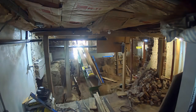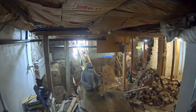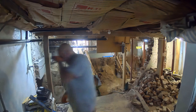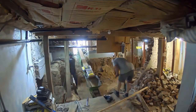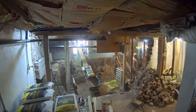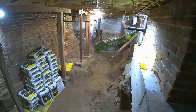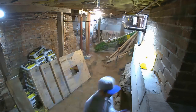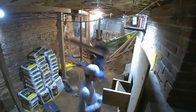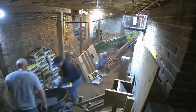They build the forms right on site since they're a pretty common shape. You can see the guys building one right in front of the camera — there's a hole near the top as a little access chute for the concrete to get poured into, and some wood to prop it up flush against the wall. The footer slab you just pour directly without a form, and for the wall it's just a piece of plywood with some reinforcement, an access chute, and more plywood to keep it vertical. These are probably the easiest forms you'll ever do.